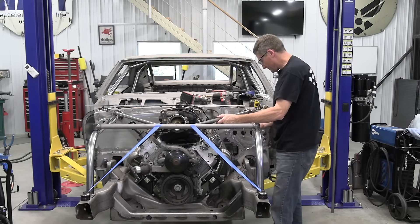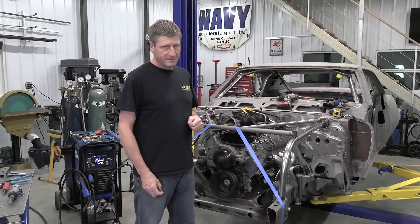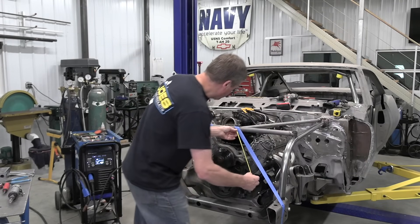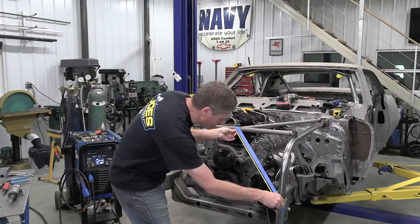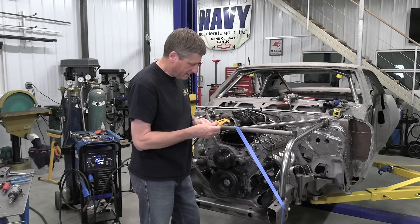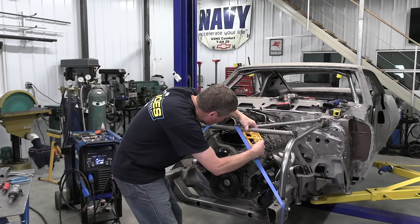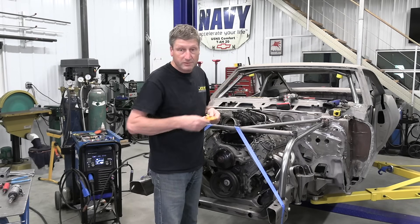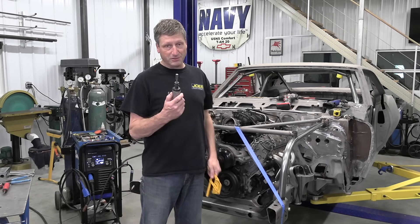That is the way to make sure they line up. Same story, different bar — kind of sounds like a dating ritual. Measuring these out first: center of the bar, the outside of the hole, 22 and a half. Take our handy dandy protractor again, measure for the angle of our cope. We'll start with 42 degrees, might have to fine tune it, which is no problem — I have my fine tuner right here.